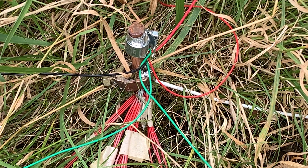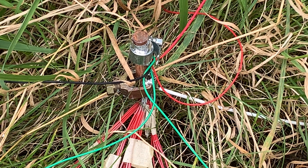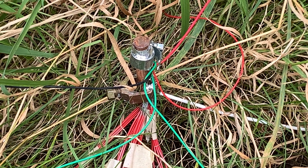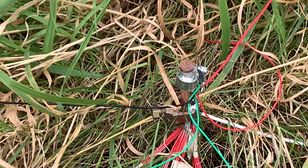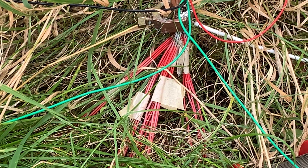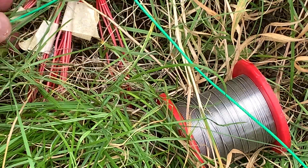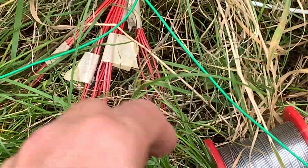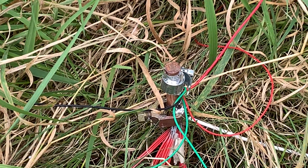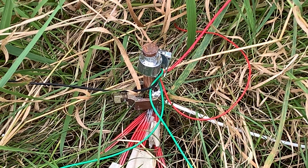The thing with this antenna is that it's been performing superbly on top band and very well on 80 meters, but my signal on top band is nearly always reported as stronger than on 80. The only difference really is that in terms of radials and ground plane radials, I've got 25 in bunches of five under the lawn that are five meters in length, and then I had three quarter-wave radials for top band, so about 40 meters.